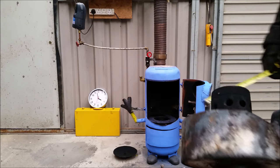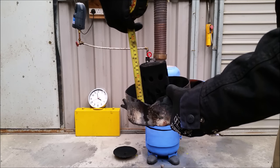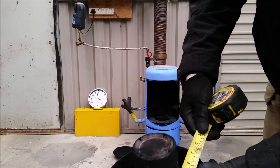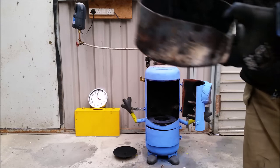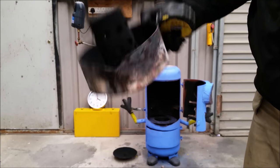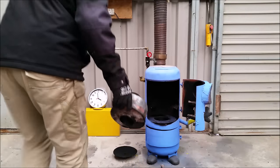This is a waste oil burner — I'll give you some measurements if anybody is new. This is a fairly successful little burner, very easy to make. This was a propane bottle, a turbo torch bottle. There is about 5 and a quarter inches sticking up out of the base. This section is 3 inches, and about 7 and a half inches in diameter. Not mission critical sizes, you can play with them. This is the first one I made; the next one was bigger. I don't know, this one is probably more successful, but both work. And I am going to install it — this is how easy it is to install in the stove.